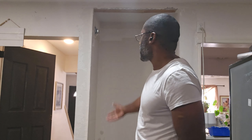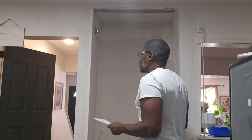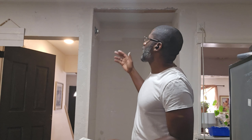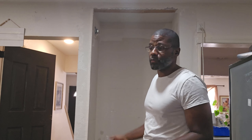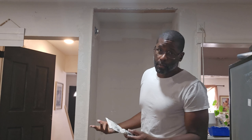I want to keep some plaster up there. After I put the tape up there, I want to put a little more plaster up there, but at the same time I don't want to put too much because it could end up making the paper crumble up — it'll have little bubbles in it or something like that. It just gets too much moisture. So I would have to come back and once it's completely dry, then I can go ahead and put more plaster, more joint compound, to make sure that you can't see the tape anymore.